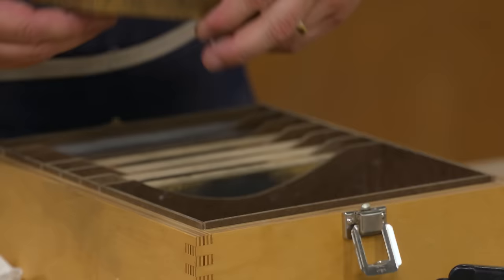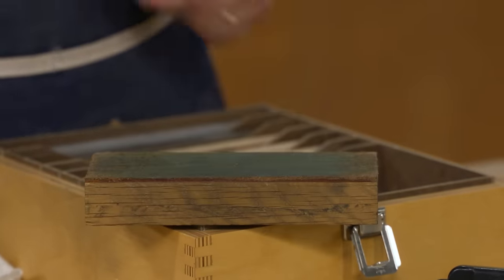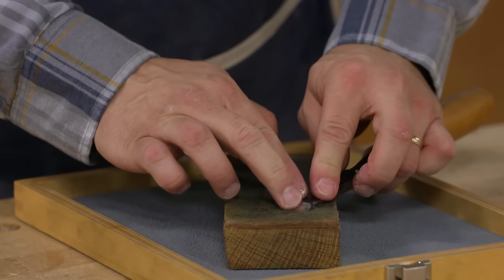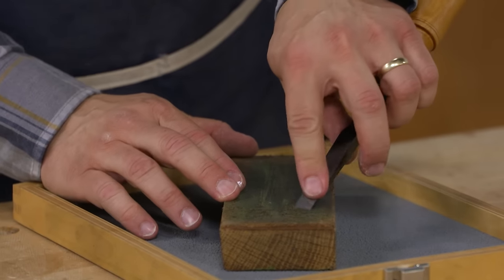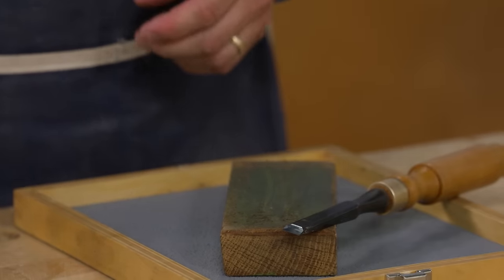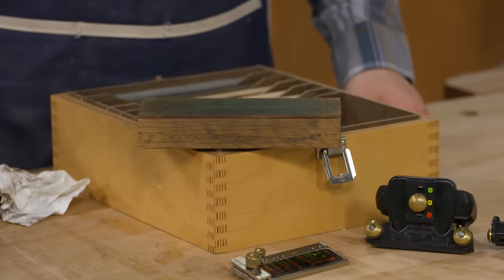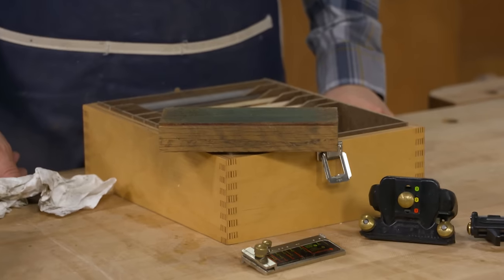The final item in the box is a piece of white oak with a strip of leather glued to it that I use as a strop — you can see more of that green honing compound on there. That puts the final edge on tools used for finish surfaces. Not every chisel or gouge needs to be polished to the highest level, but when they do, I'll come here and stroke them on the strop periodically to keep them at a high level of sharpness.